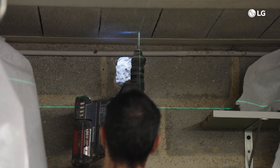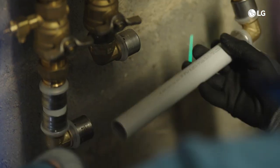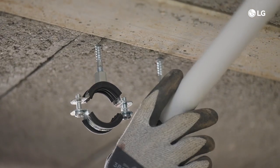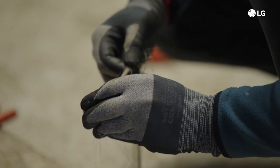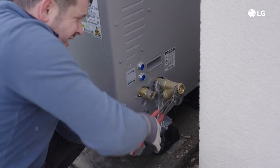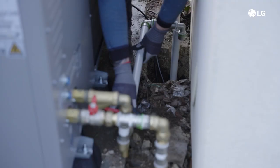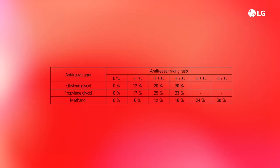The core hole through the outside wall must be prepared in advance. Be cautious when cutting or welding pipes, ensuring no defects occur and no particles remain in the pipes. Drainage provisions must be made for safety valve operation and condensate discharge. When connecting water pipes, ensure tight fittings and use appropriate sealing methods. Connect the drain hose. For the outdoor unit water pipe installation, make sure that the outdoor unit piping is protected from freezing, or add an antifreeze like glycol with the mixing ratio as specified in the manual.